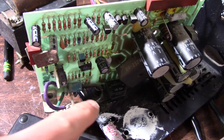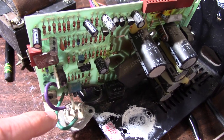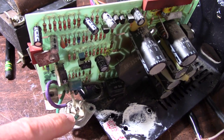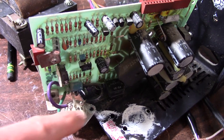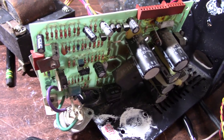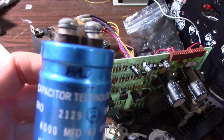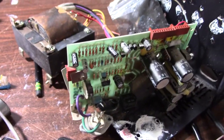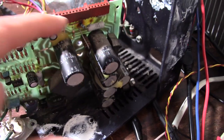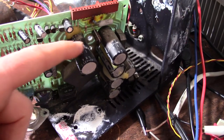I tested the diodes and all the transistors, and this triac here tests open when powered down, which means it's working — it's in series with the mains and the power transformer primary. Apparently this circuit is working because it powers up, but it powers up into a short due to that one capacitor that's bad — this one here — dead shorted cap.